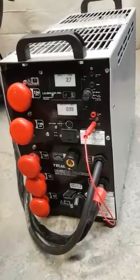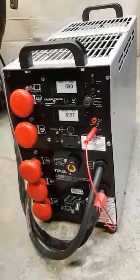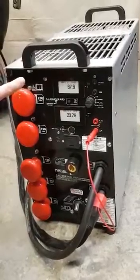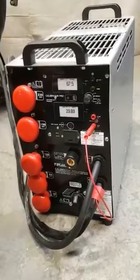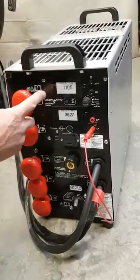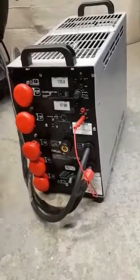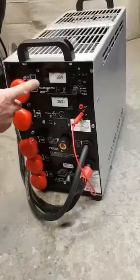The power source is going to shutdown mode because I've added too much load — it's quite a clever power source. It's shutting down because it's seen the current is quite high and the voltage is too low for the welding parameters it thinks it should be working at, so it's going to shutdown. It's probably got an anti-stick circuit to stop the electrodes sticking. I'm going to wind the power source up further. You see now the voltage is too high — it'll be current for the stick process. I'm going to add a little bit more load. Currently we're running at 198 amps on there.